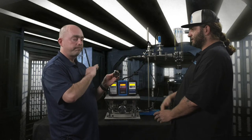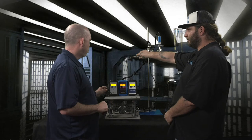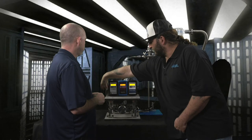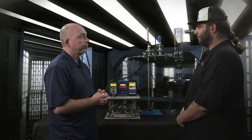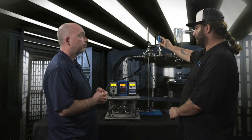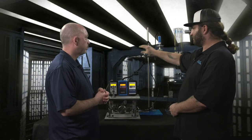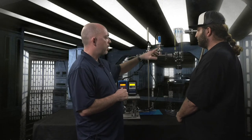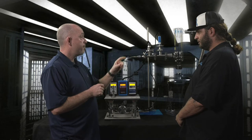For this sensor you can clean it with whatever you want. For a falling film always running under vacuum you'd use the piezo sensor, and for a closed loop application you'd use the compound sensor — essentially the same type but the internals differ and it operates for both pressure and vacuum. As for cost, the 10 torr capacitance manometer package — sensor plus controller — is around $1,500, so it's quite a bit more.